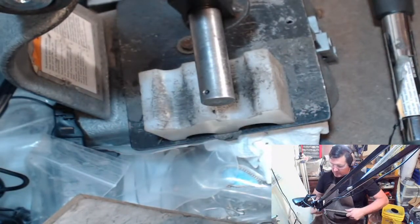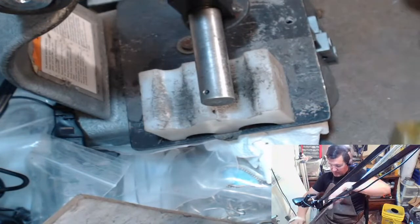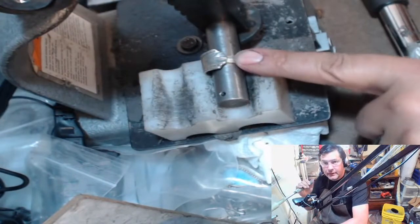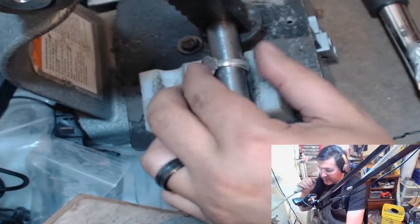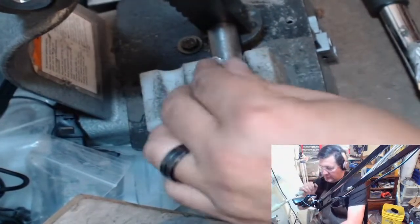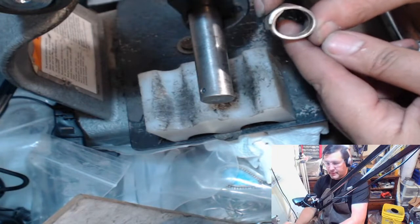Almost there. I was wondering why it wasn't twisting the ring. And the metal always springs back. Come on. There we go. Okay. So now by hammering it on the mandrel, I've been able to get it straighter. So that's one way. If you tweak the ring a little bit, you can watch the front slide over. So that's how I'm getting the main ring shape.